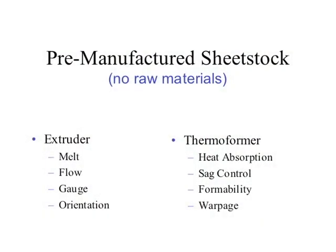In terms of the sheet stock itself, when manufacturing — taking raw beads and putting them into sheet form — the extruder has to have certain physical characteristics of that resin blend to match his process of heating the beads, forcing it through a machine, and turning it into sheet stock. Then we as thermoformers have our own needs of the material. Whoever develops the basic formula of polypropylene has to serve two masters: the needs of the extruder to turn out a good product, and the needs of the thermoformer. Anytime you have to serve two masters, it becomes difficult because it's always a compromise.